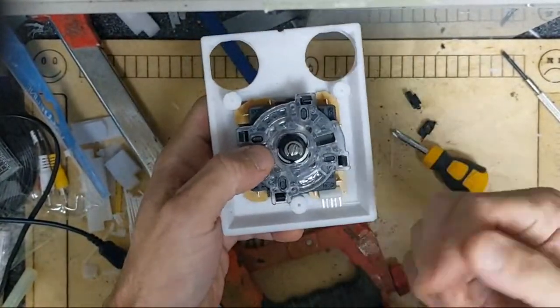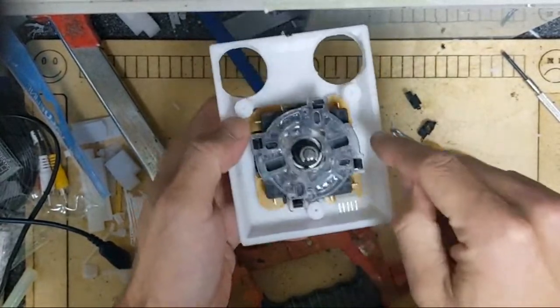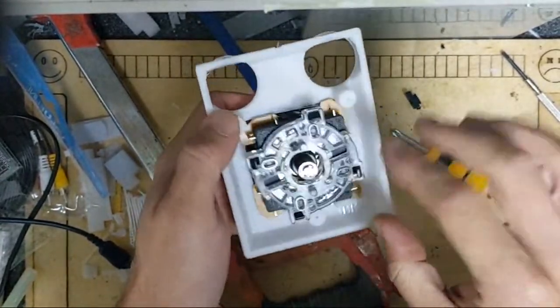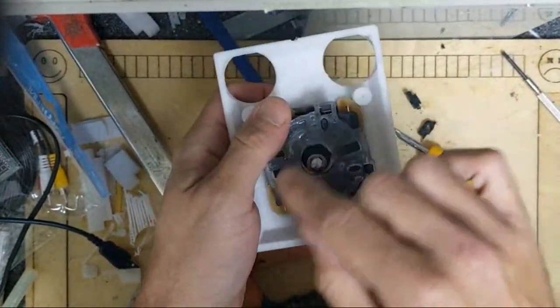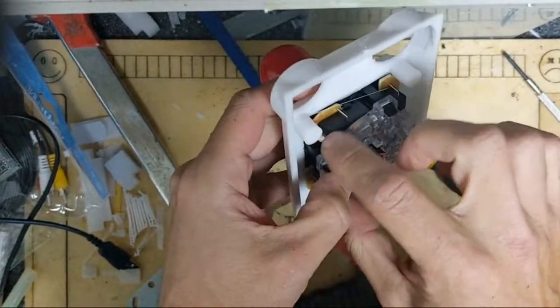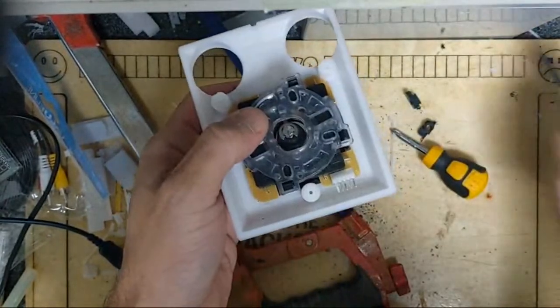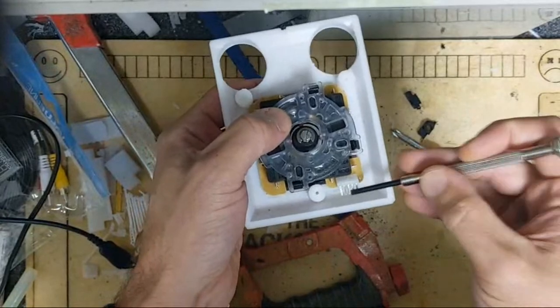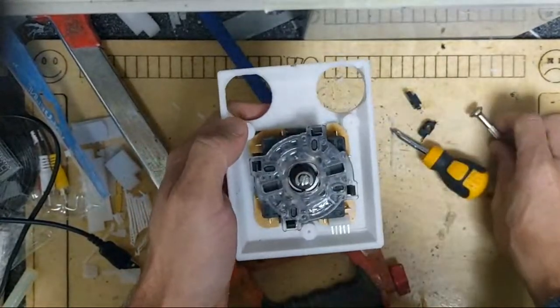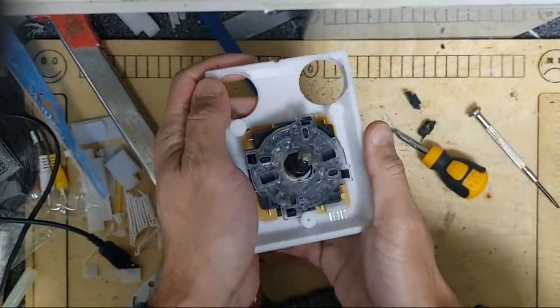So if you want to wire them up, they're really easy. You've got a common ground on this PCB that's already going around. So sometimes you see them with wires, yeah? That's annoying. So these ones are all pre-wired, as it were, because they're on actually a circuit board. So if you look here, though, you've just got five pins. One is a common, and then you've just got the switch on each one. So it's super easy to wire up to whatever you want, really.